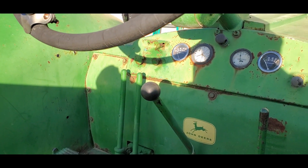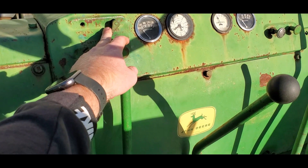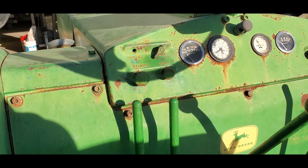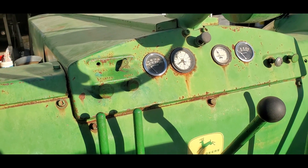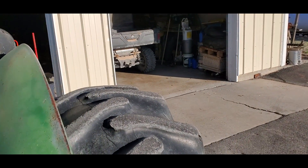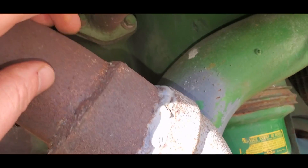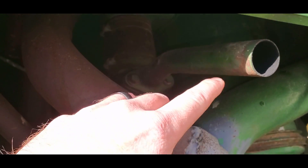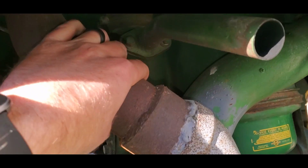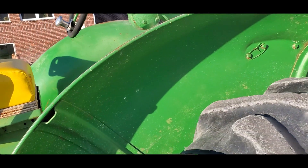When I start this, what I'm going to be doing is, first of all, turn on your fuel. Pull out the starter, maybe choke the starting motor if it needs it. That'll start up and we'll let it run for a minute or so. While it's running, it's going to be warming up. The exhaust from that goes in and it warms up the intake. Your exhaust from your pony motor actually warms up the intake air on the big diesel engine. We'll let that starting motor warm up and it will help the big engine have some warm air to start.